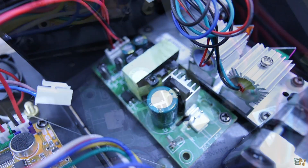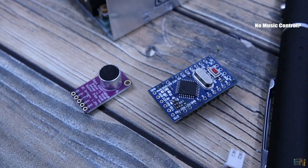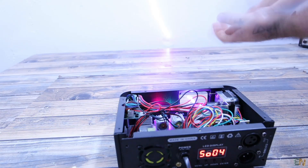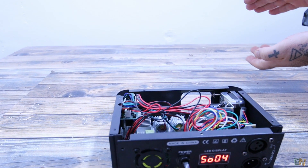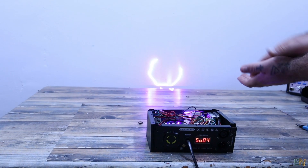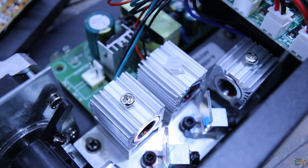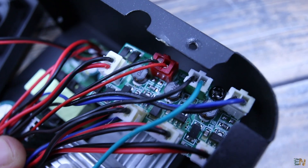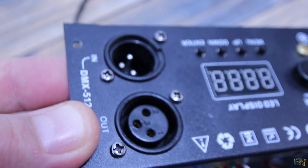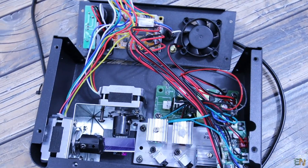Inside we have a power supply for 12V and then we have some sort of controller board. Remember that I said this machine doesn't have a sound control, so why is there a microphone on the PCB? Well, that's because it has a crude mode where it activates a stuck movement when it hears sounds. So it's not the laser moving on the beat of the sound, just activated by the sound and the movement is random. We also have 3 laser modules for RGB, another controller board for the lasers, 2 stepper motors with some smaller mirrors, some input connectors for DMX communication, and a cooling fan. And that's it, that's all that we have.